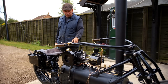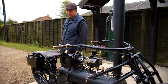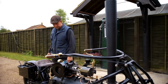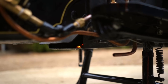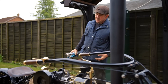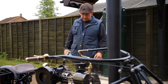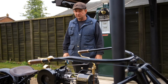When this gets going a bit more, we can turn this blower off and it'll just draw the fire itself. And then we can shut the damper flap at the bottom — that's the same as the damper flap you'd have on your log-burning stove at home. Like a coal fire at home, you have a flap which you open up, it lets the air draw through the fire grate and through the coals and sends it up the chimney. If you shut the damper it just quietens things down and it'll burn at a less ferocious rate.